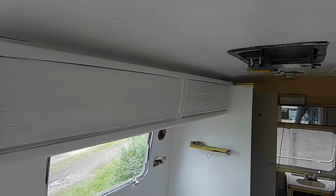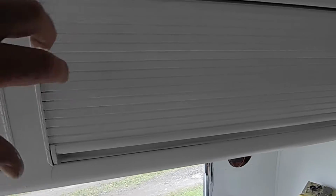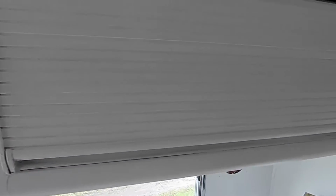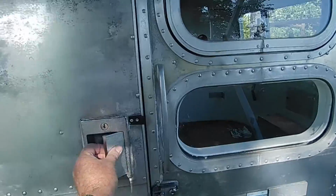A little worried about these tambour doors. Keep lifting them up after I paint them, because you want to get in the sides there, because there's always a line. And then when you tuck the paint in there, of course, it wants to jam in the track, so you have to keep moving them while they're drying.